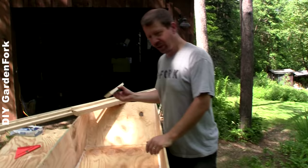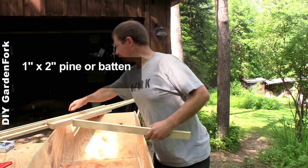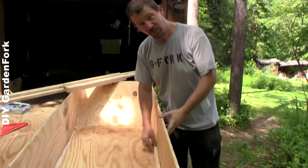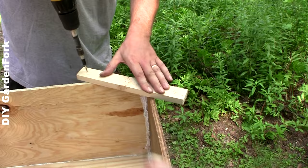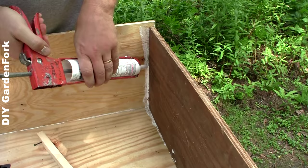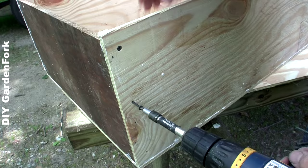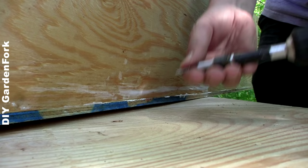Here's my idea of changing it up a little bit. This is called batten or one-by-two — we use them for garden sticks. We're going to measure all these lengths, place this in here like this, and screw it from the side and screw it from the bottom. First laying more caulk, then screw this in, and that'll make it pretty strong. I'm using three-quarter-inch wood screws.